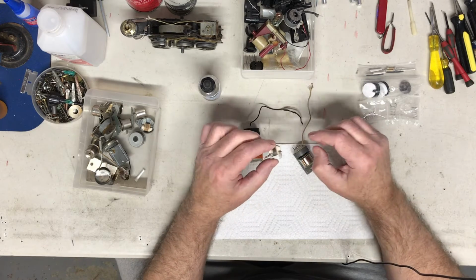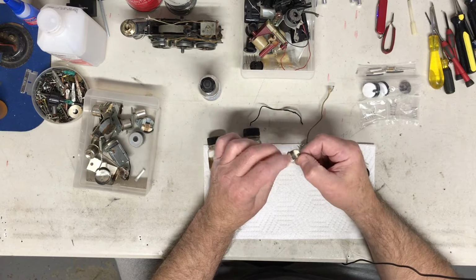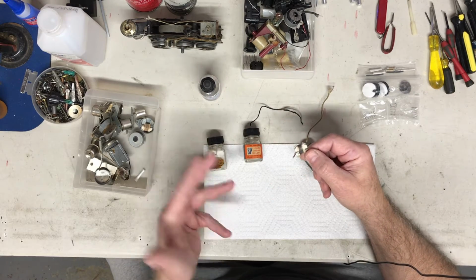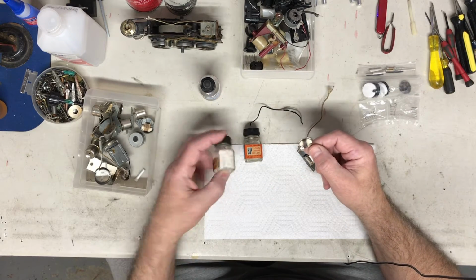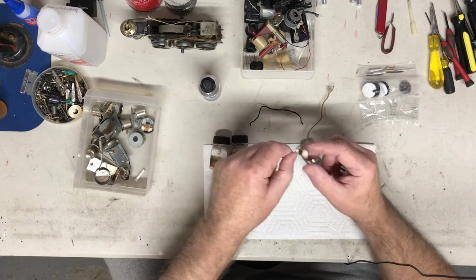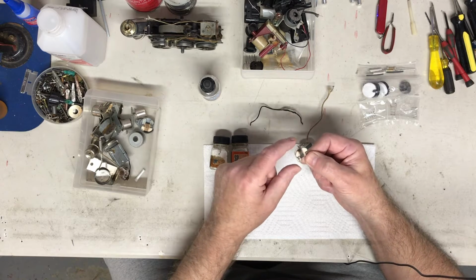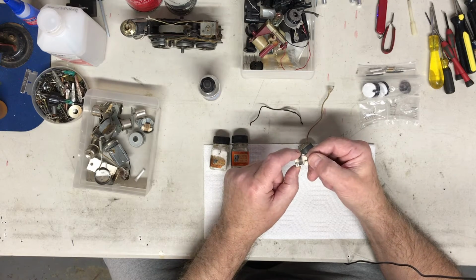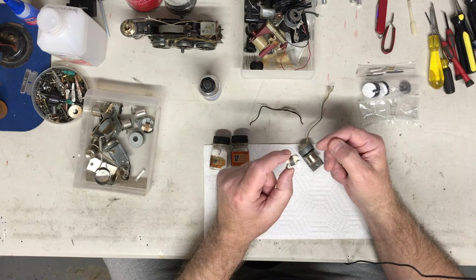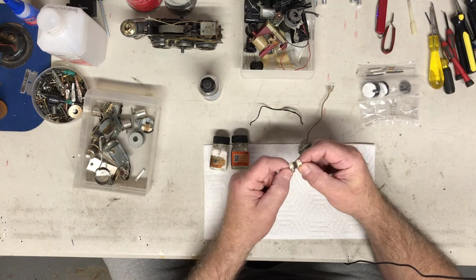And the pill would drop through the hole onto this element, and as it reached temperature, it would melt, it would smoke. It would burn this pill and make the smoke. So obviously these are still available, I believe, from Jeff up there at the train tender in New York. I think he still has these parts. So you can repair yours.